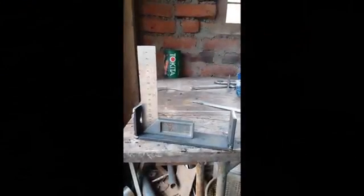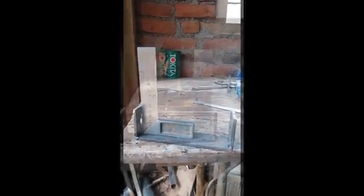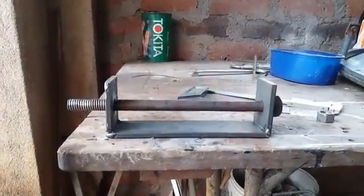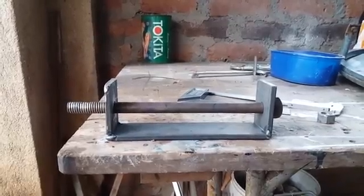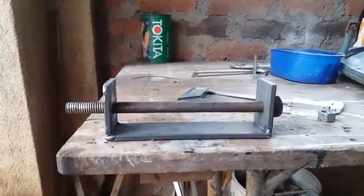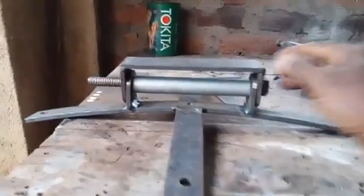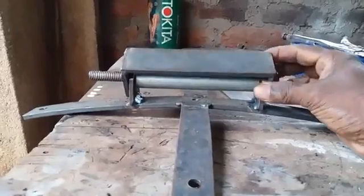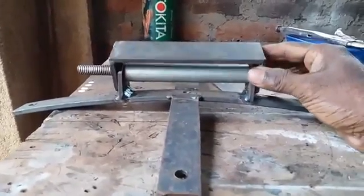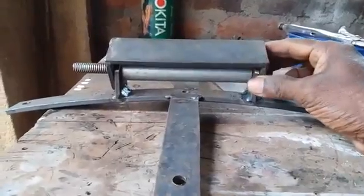This angle should be accurate, otherwise we will not be able to get the proper signal level. This bolt should be exactly parallel to the mount, otherwise all the elevation will be changed. Now look — the upper part of the mount is completed. Look how it works.